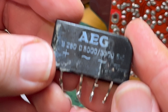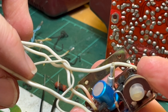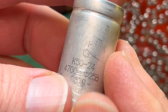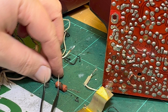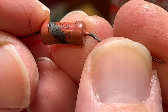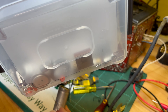I think it's October 1979 - over 40 years old. I think it's neat, so I'll keep that. I don't really need this bridge rectifier - I've got plenty. I assume this is the 12 volt stabilizer, or regulation stage as they call it in Russian - keep that. The smoothing capacitor is 4700 microfarads, 25 volts - looks like 1979 as well. And here is the resistor that had the interesting scorch mark on it.